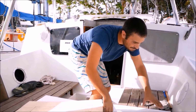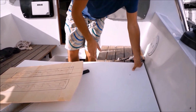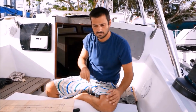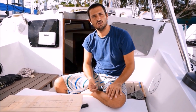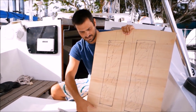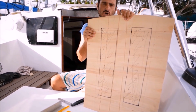The plan right now, we're using 1/4 inch Starboard, so I got a 48 by 48 inch piece of Starboard. The 1/4 inch piece of Starboard is going to be the first layer, the top layer that you're going to see from the outside. We'll cut in the inserts as needed, but it'll be all one big piece. Bolted to that is going to be a 1/4 inch aluminum frame. The frame runs across the bottom, sides, middle, and side. So it's going to give it the majority of its rigid structure.